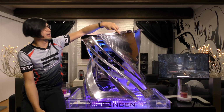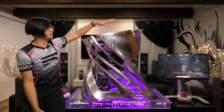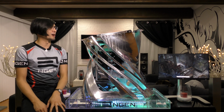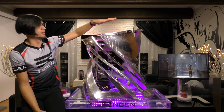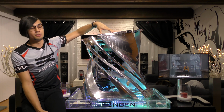And the reason I did that was so I could replace these shower heads. So I can adjust the nozzles and jets independently without having to redo this whole central area here, which is why this looks so crazy complex and convoluted, but it's easily my favorite part of that. And then of course from there, it rains out from the shower head. Each one is tailored to the spire that it's on, and the number of jets and the placement of jets is tailored so water flows down smoothly.